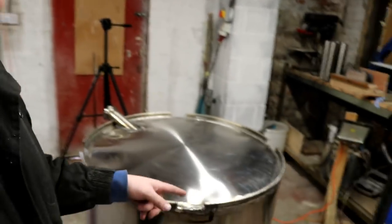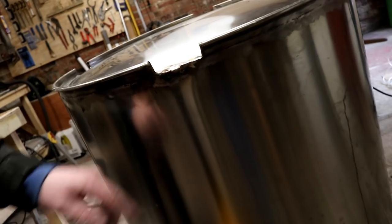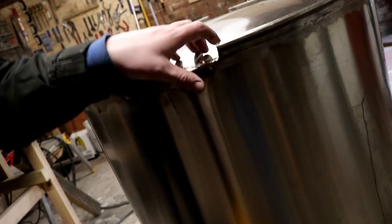Well I dropped a little bit of a bollock there. When I was cutting out the sections on the side, on two of them, I went a little bit deep on the cut and I burnt through to the inside of the tank. So I've just had to spend an hour patching up a hole which was about half an inch wide. Took some patching — inside outside grinding, inside outside grinding — but we've got them sorted now, and looking at that, it doesn't matter about the aesthetics because we're going to have a leg over that.